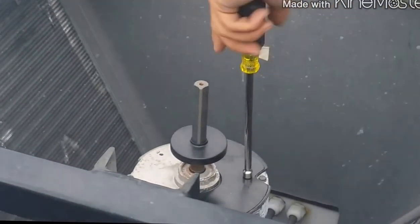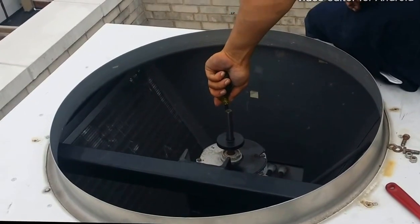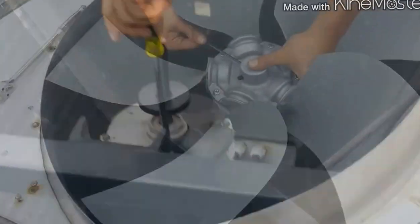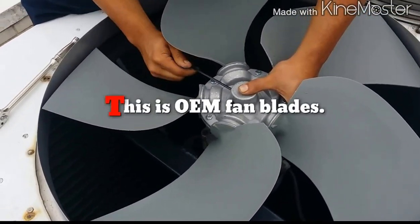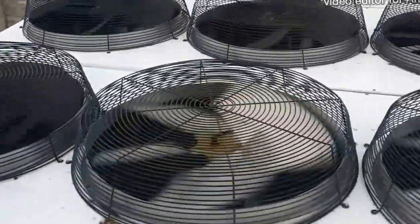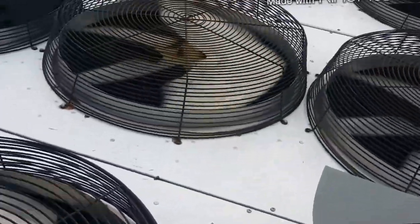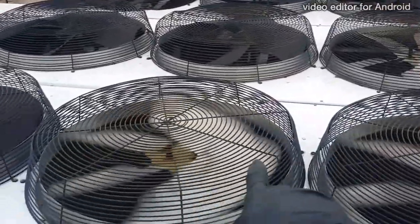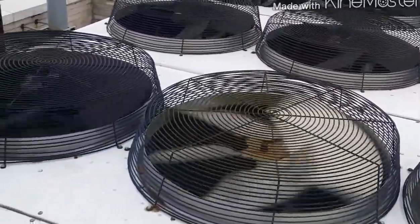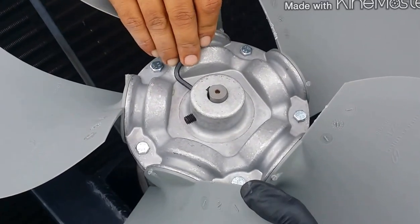I'm going to hold it for him while he puts the bolt on the third one. We're waiting on two rain shields — those little things right there. Like I said, these motors have been here over two months; I was supposed to come back but something fell through. We're going to wait on those and put the plastic fan blades on. Originally I ordered four blades to replace the four aluminums because they weren't discharging enough in the summertime. I called the manufacturer and they said we had to go with the OEM. I did have high head pressure on this one, so I ordered them, and the three blades for these three motors are coming.